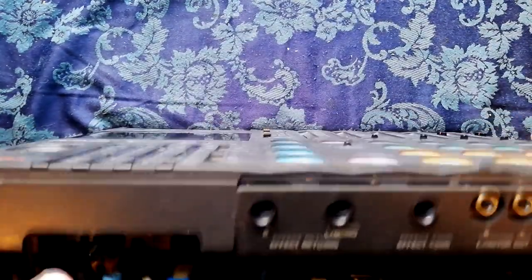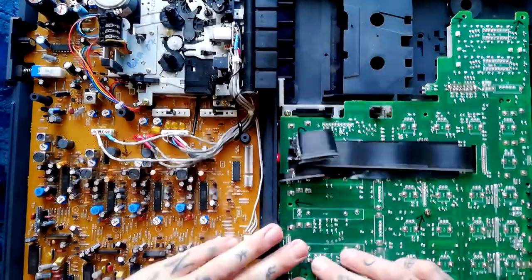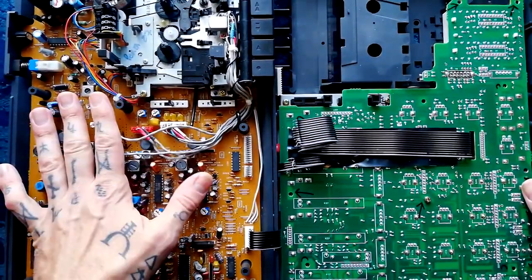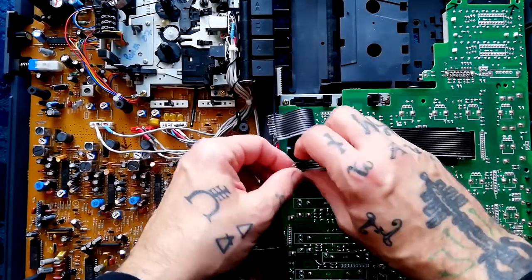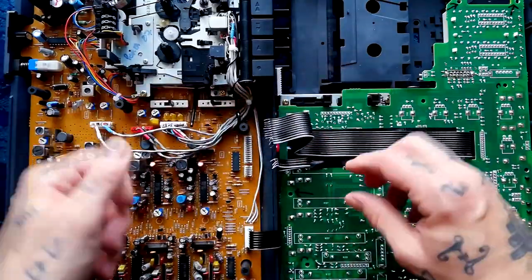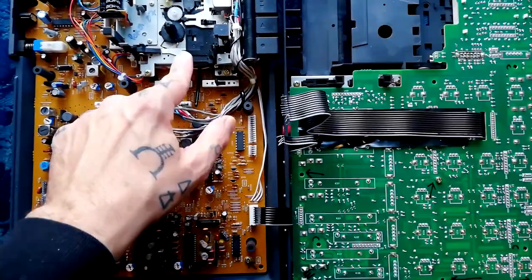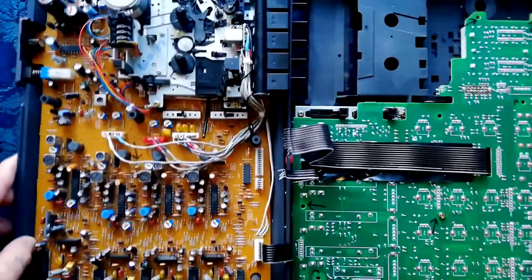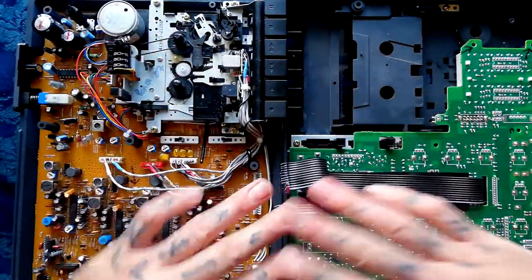Your best opening is from the back. The connection between the two halves — your mixer circuit board and your record/playback amplifier — is via ribbon cable. I've already opened some of these, which I now regret. Before I get to the transport, I'd say: if you possibly can, just deal with as much of it with these two boards still connected.